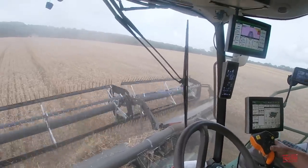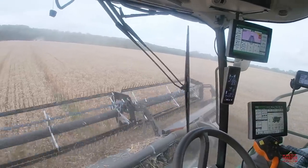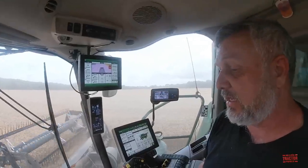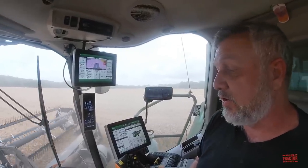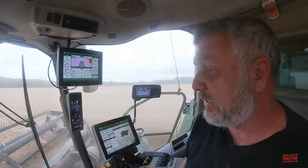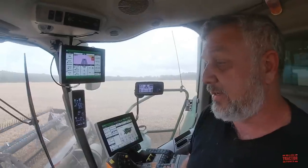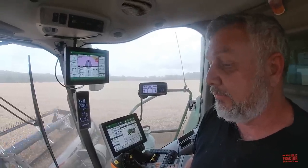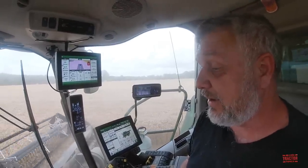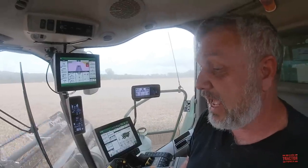So watching the combines out in the ground, it looks like you're moving along through the field pretty good with these. Yeah, we're moving along pretty good. I really like the cutter bar on these things. It's got that Schumacher cutter bar, and it really does a good job on cutting the wheat. I really like it, and we've had good luck with it cutting beans. The guards, they don't break. They're actually made out of not cast metal, but just regular steel, and they do a super job. We've just been really, really happy with that cutter bar.